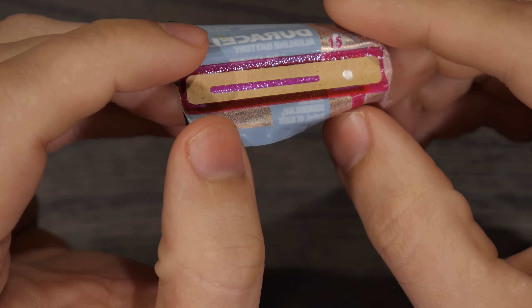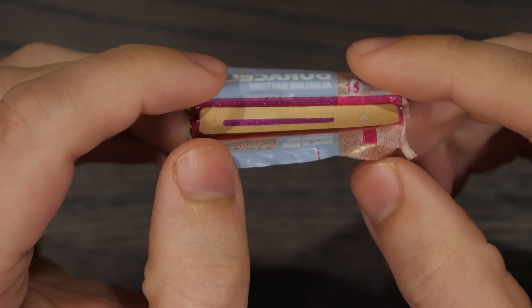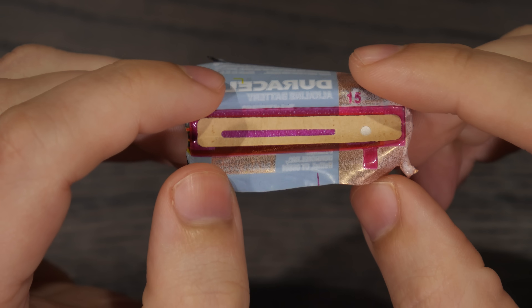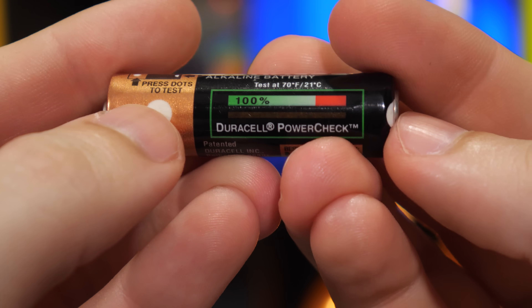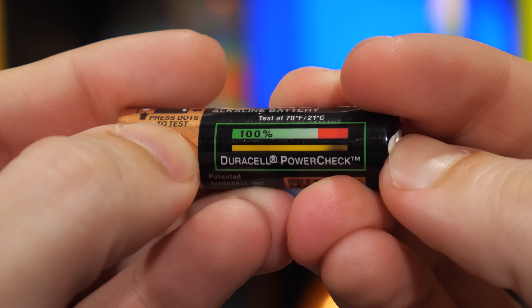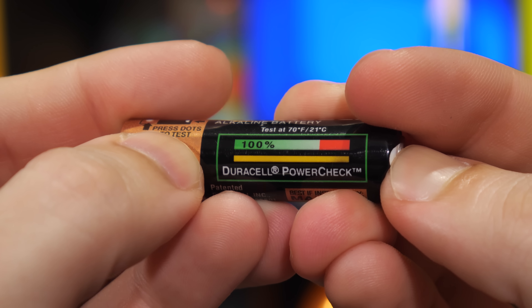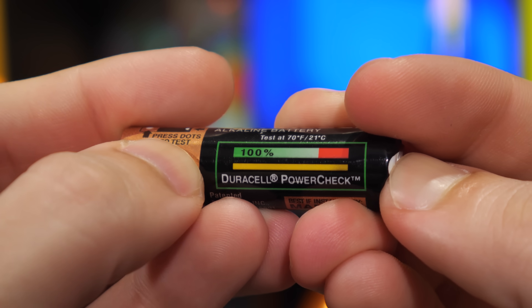Looking now at the back side of the label, we'll see that those testing dots are above electrically conductive pads. The pads on the negative side are these three gray patches. The positive contact patch is quite obviously a metal foil of some sort, and it sits behind a round hole in a thin piece of beige insulating material. That insulating layer keeps the pad from touching the battery shell unless you actively press on the label and force it through. If you exert enough force on both dots for their respective contact patches to touch both ends of the battery, you complete a circuit — to a tiny little heater.